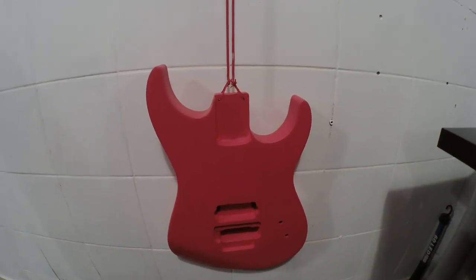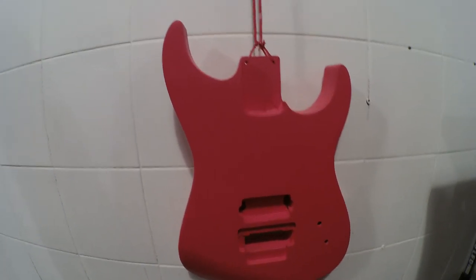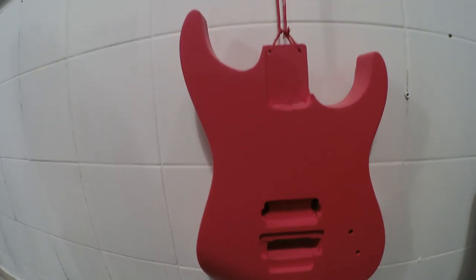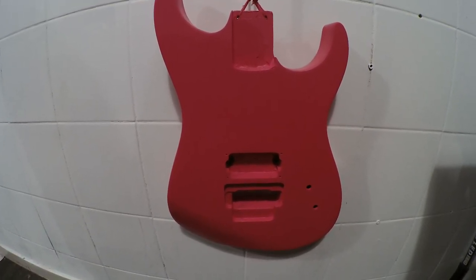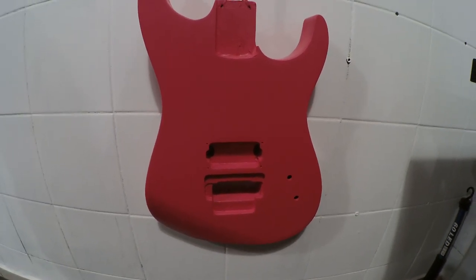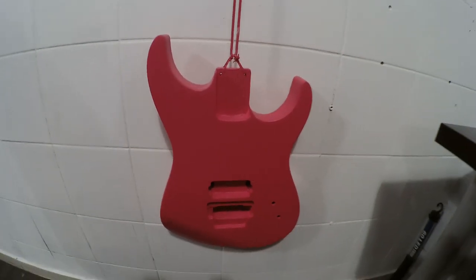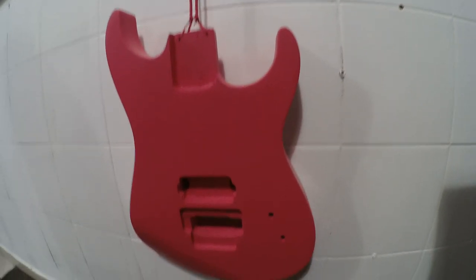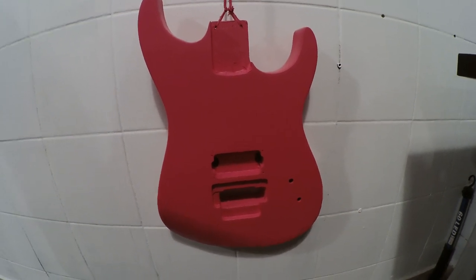The third — or really the sixth — coat of paint is on. It turned out pretty sweet, I'm happy with it. I'm going to spray it with 2K varnish clear coat next, and we're almost done. I think I'm about 25 working hours into the project. The project is pretty sick, I love the color, I love how it turned out on this third and final color coat. We'll move to the clear varnish in about 40 hours — see you next day.